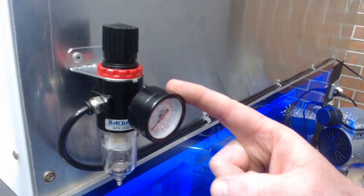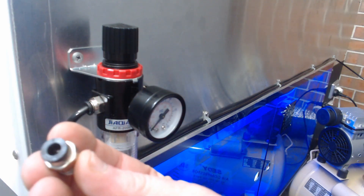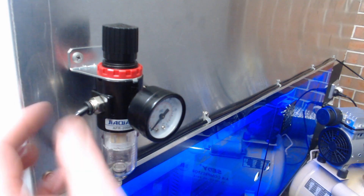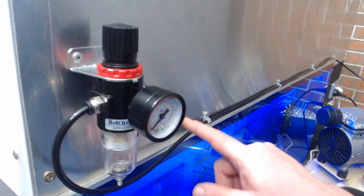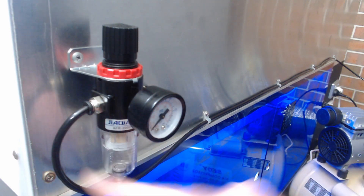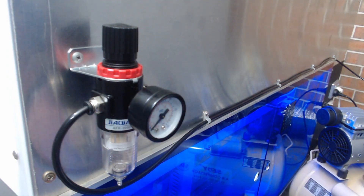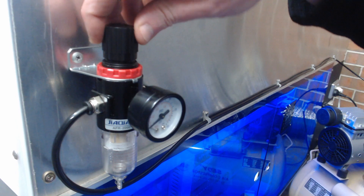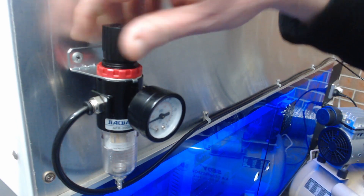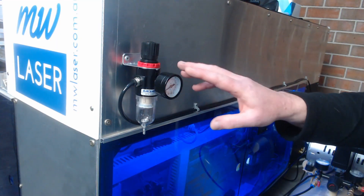The air regulator I purchased came with some standard NITO push fittings, and I've removed those and using a quarter inch thread replaced them with push fittings for the six millimetre air pipe — those just push to connect, you can disconnect them and push them in to lock them into place. We have our airline coming from the air compressor and out the other side. On the back of this flow regulator we also have an arrow indicating the direction of airflow. Once you have your pressure regulator hooked up, you can use the dial on top to set the required pressure you'll be supplying to your laser nozzle.